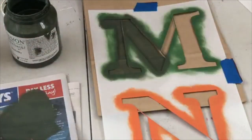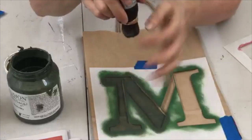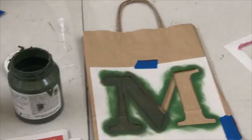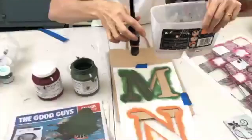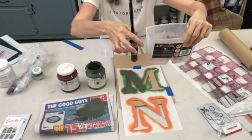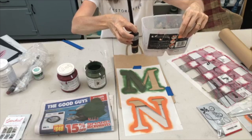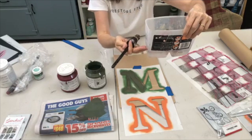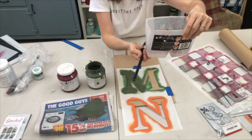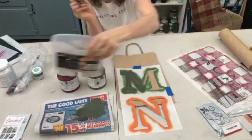The brush I'm using is a Cling On furniture painting brush — they're actually quite self-cleaning. You put water in a brush tub up to where the ferrule is, just where the bristles are. Leave it sit for an hour and all the paint just drops off the brush and sinks to the bottom.